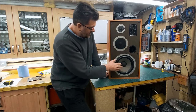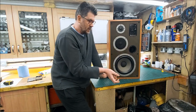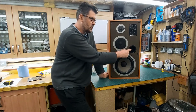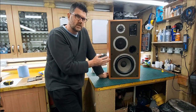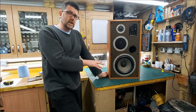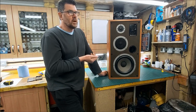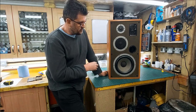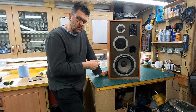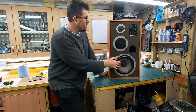There's obviously a big magnet here because that's pulling in a 10-inch paper-cone woofer and a port. Looking at the measurements, I'd suggest this port is tuned to about 40Hz. These have great bass performance — looking at the near-field measurements, about 40Hz is the 3dB down point, and running the signal generator at 30Hz they've still got great output.